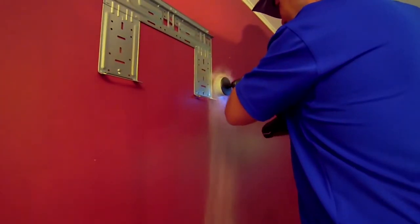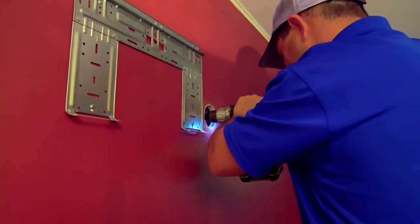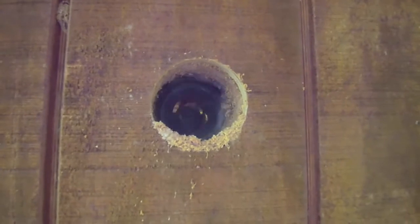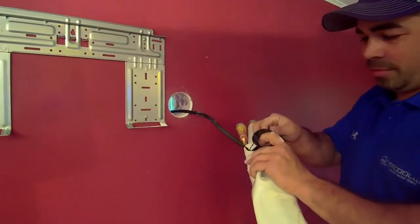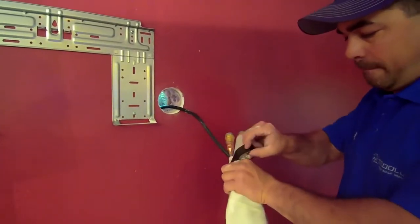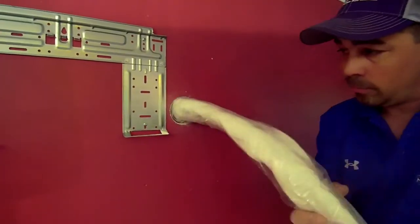The hole that you cut in the wall will connect the indoor air handler with the outdoor condenser. Cut the exterior end of the hole slightly lower than the interior — this angle will help proper drainage. It's helpful to have somebody on the other side of the wall. Bundle the piping, drain hose, and signal cable together with electrical tape before you pass it through the hole. Make sure the drain hose is on the bottom of the bundle.